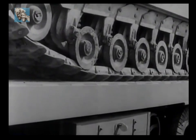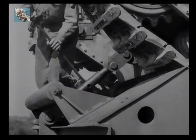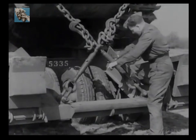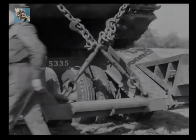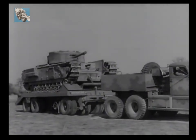With the casualty safely on board and after the loading tackle has been disconnected and stowed, the casualty is strained down — a single strainer on the front and crossed Warwick strainers at the rear. Never allow the threaded portions of your strainers to foul. Once again, remember to recheck your straining after the first mile on the road.